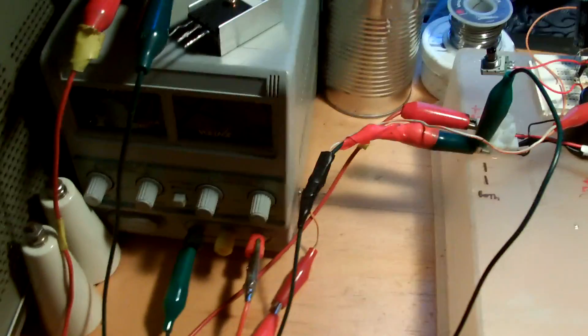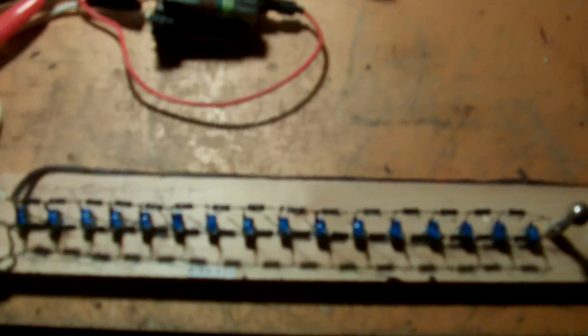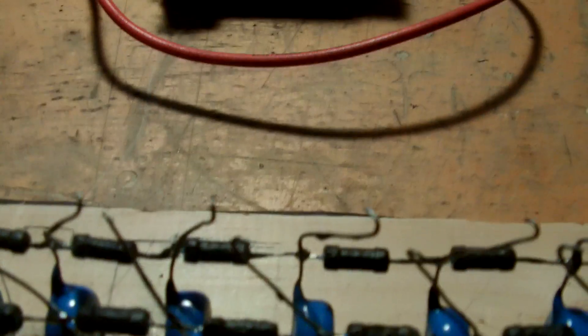12 volt supply for the gate, 15 volt supply for the flyback. I'm actually going to run it at just about 3 volts — it doesn't take much to charge these caps here. They charge in parallel and discharge in series across each individual spark gap.